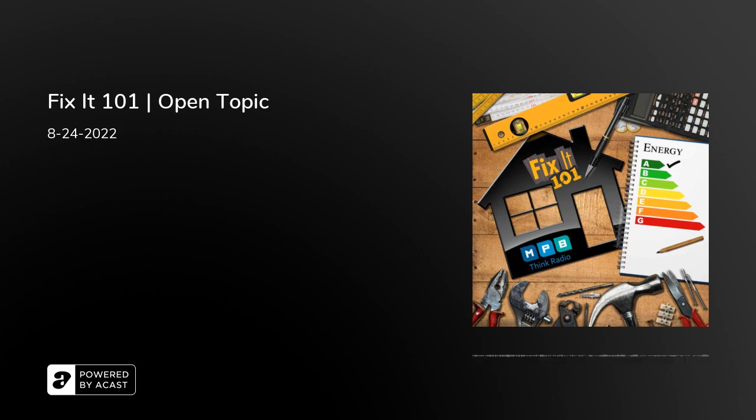Dave brought up a great point. Buy the best paint you can afford. But think about this. If your substrate moves, meaning the part you're putting this paint on, and I'm talking exterior, if you're painting wood and it's not primed properly and the wood starts expanding and contracting, it's going to crack the best paint. A concrete board is not going to move on you, and that's why the paint lasts so long on it.